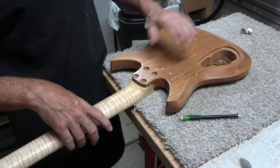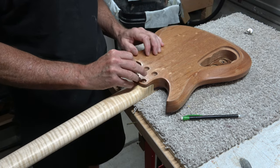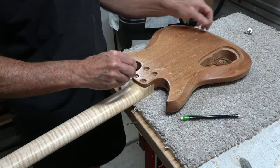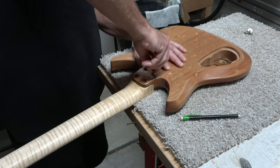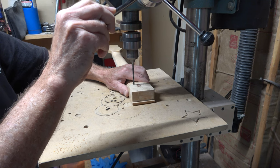So I think it's better to wait to drill those holes until later. What I did was press the neck into the pocket, make sure it was lined up perfectly with the center line of the body, and then mark the position of the neck mounting holes so that I could drill those on my drill press.